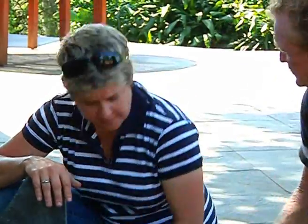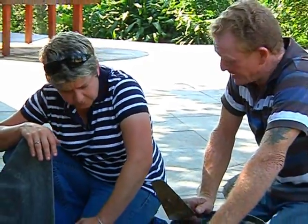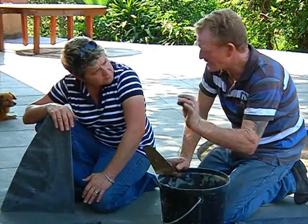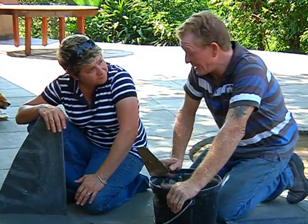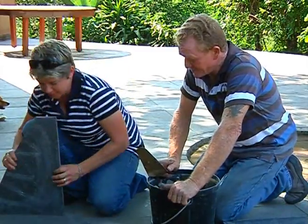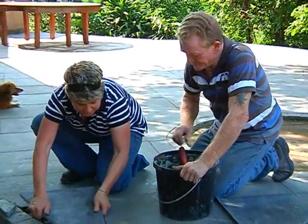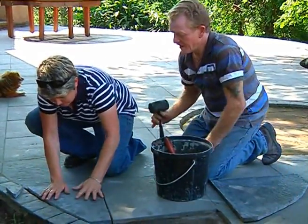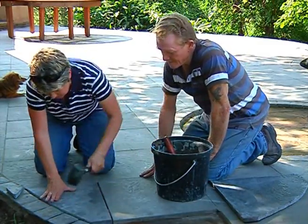Garth, let's just recap. What was the mixture that was used here? We're using 3 plaster sand to 1 part cement. Plaster sand is much finer than a building sand. In building sand, you find a lot of little stones, even guinea pebbles inside. For sure. And to tap your tile down on there, you're going to have to replace that tile. Right, we got it. So now that we've got it nicely in place, agitated a bit, here we go. Let's take a look. In this little guy goes. There we go. Fantastic. Of course, now this is the part where you've just got to tap him down.